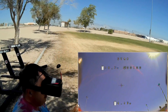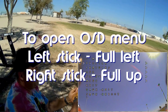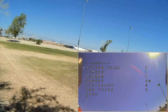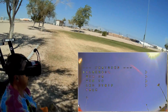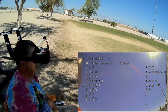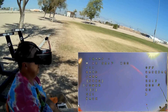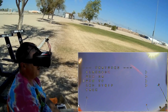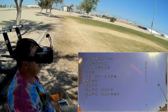First thing I want to show you before we take to the air: I'm going to put the OSD menus on. To do that, you move the left stick to the left and pull the other one up — and that brings up the menu. We can go to OSD to adjust on-screen display items. But what I'm looking for is features and video transmitter. You can adjust the frequencies, band, channel, and power levels. Right now I can see 200, 400, 600. We don't want to go to 600 — remember what I told you. Keeping it at 200, so I'm not going to change that. This has higher power levels than advertised. Let's exit without making any changes.